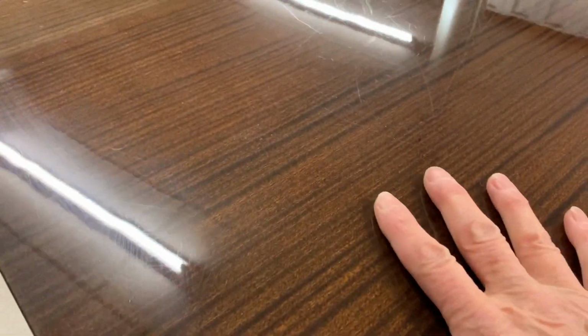But just look around it quickly, you can see that it varies, so that side is quite light as well. So we would have to strip that. The problem with stripping polyester is you don't really know how much it's got into the grain of the wood. So it's a bit of an unknown really until it's stripped off.